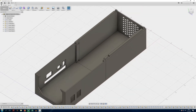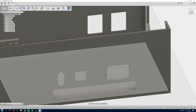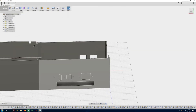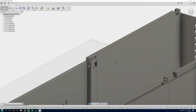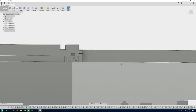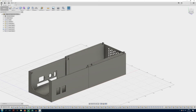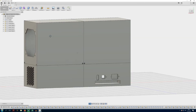I had to thin the walls here to 2mm; the rest of the walls are 3mm. This area is going to be used for the heat pad as mentioned in the previous episode. There are some interconnect tiles for the top parts of the control box but these aren't final, so just ignore those. There is no door yet on one side and basically nothing on the other side. The aviation-style plugs will probably go on a separate panel that gets screwed in to make mounting easier.